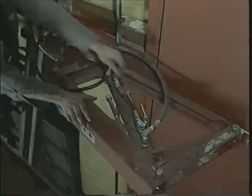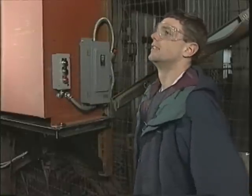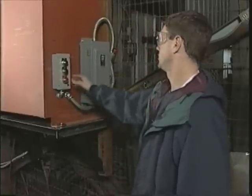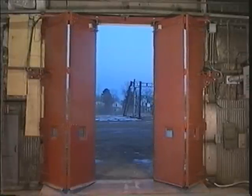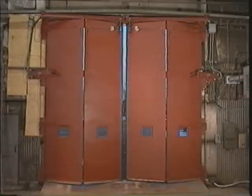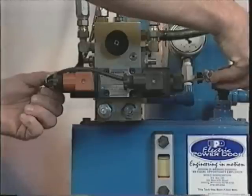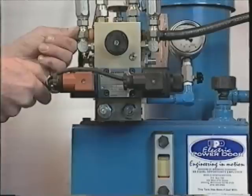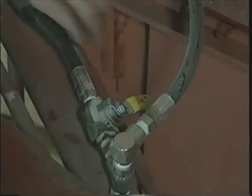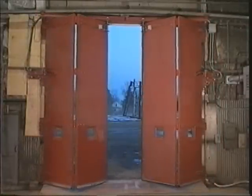Close both bleeder valves approximately one-third and remove the wedges holding the door shut. Operate the hydraulic pump unit in both open and closed directions using either the push buttons or by manually operating the solenoid valves. The door may start to move when the bleeder valves are approximately one-third closed. After operating the door for a few cycles, move the bleeder valves to the two-thirds closed position and continue to operate in both directions. Monitor the hydraulic fluid so it does not drop below the red line. The bleeder valves can be completely closed after cycling the door a few more times — at this point, almost all the air in the system has been removed.